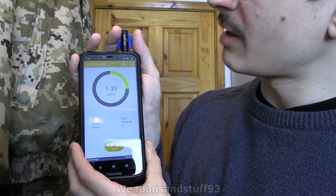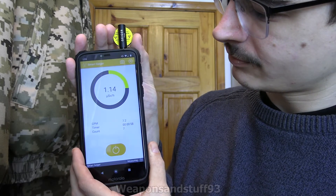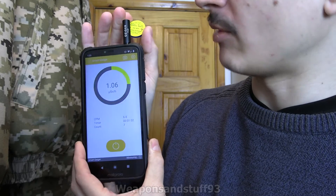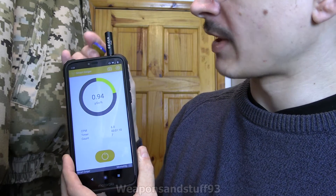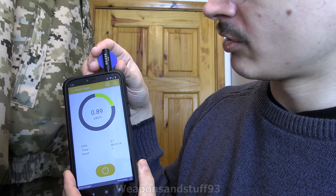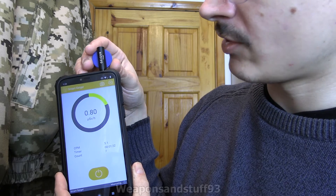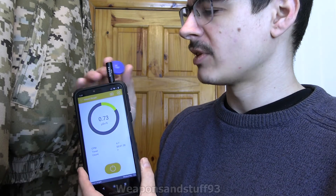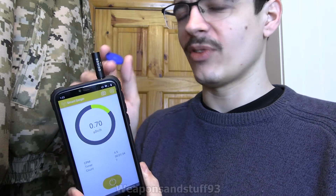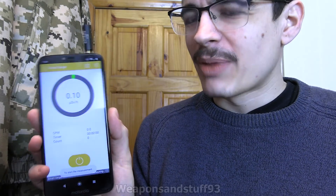What we're going to do is flip this around the other way — this should block most of the beta radiation coming off — and see if we get a lower number. Something worth pointing out is it might be that my phone case is a bit bulky and messing with the contact. That wouldn't surprise me actually. The number doesn't seem to be going back up, so I'm going to remove my phone from its case and try it again, because cases like this generally don't let headphone jacks sit really flush. Let's try again — it's connected to the headphone jack there with nothing getting in the way of it.